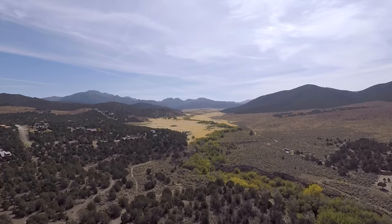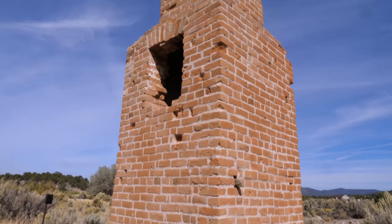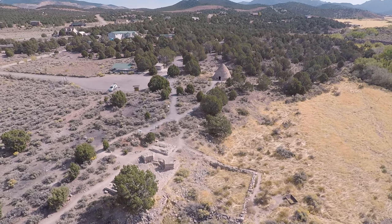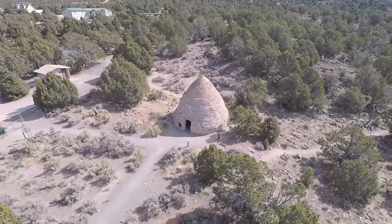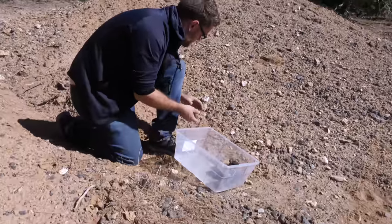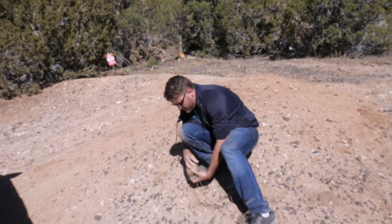But first, they tipped me off to a good location to find some additional iron ore to smelt. Down in southern Utah, there is an old ghost town called Old Iron Town, formed in 1868 as Iron City. It was an attempt by Mormon pioneers to become more self-sufficient in their iron supply through ore mined from the nearby Iron Mountain, mostly abandoned in 1876, though still occasionally mined when prices make it profitable. I'm here now near that ghost town, and a lot of iron ore tailings are scattered on the ground — pretty good candidates for smelting. I have a little magnet here and I can test them out; they are in fact magnetic, which means they're magnetite and should smelt pretty well.